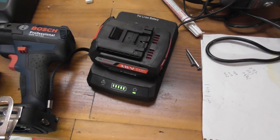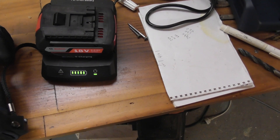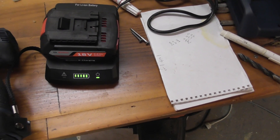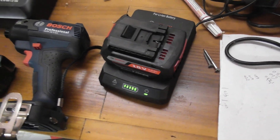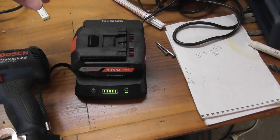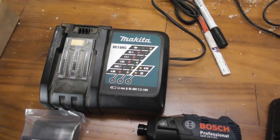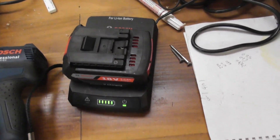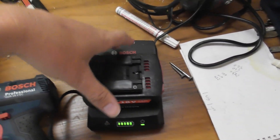She's all charged up but she's not quick — which doesn't matter, because for this sort of thing the tool with the battery is always going to be on the charger when you're not using it in the workshop. Use the tool, finish using it, straight back on the charger, so it's basically always going to be fully charged. It took 45 minutes to charge a 2Ah battery, which on a job site would be pretty useless. The Makita rapid charger does a 3Ah battery in 22 minutes, and in 45 minutes can do a 6Ah. This charger draws only 3A whereas the Makita does 9A — basically exactly three times slower.